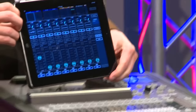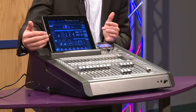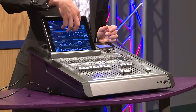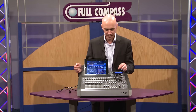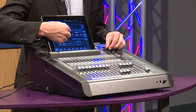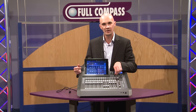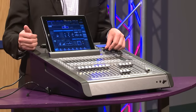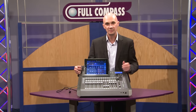Another way to use it is a great feature we're calling touch and turn. What you do is put your iPad into the dock, and as you select a channel on the M200, it will change the channel displayed on your iPad — just like you'd expect with a traditional digital console changing the screen. But what's great is the precision you can get by using the hardware controls from the M200. For example, here I want to hit gain — I hit the gain and I'm able to adjust that with the value knob. The precision of hardware is key: often with an iPad it's hard to get an exact one dB increment when adjusting gain or EQ. So you can quickly bang around the parameter you want and use the value dial to adjust it precisely.